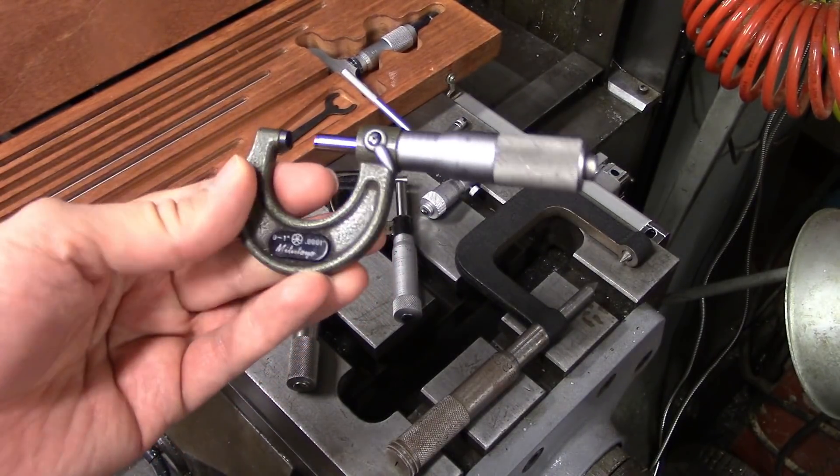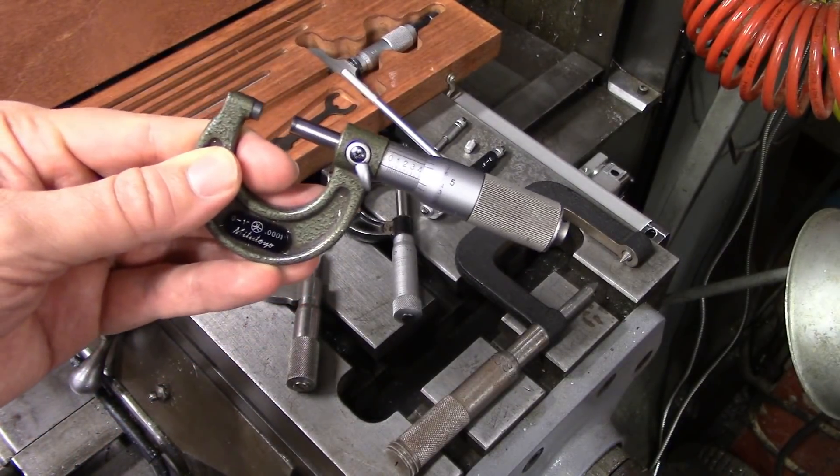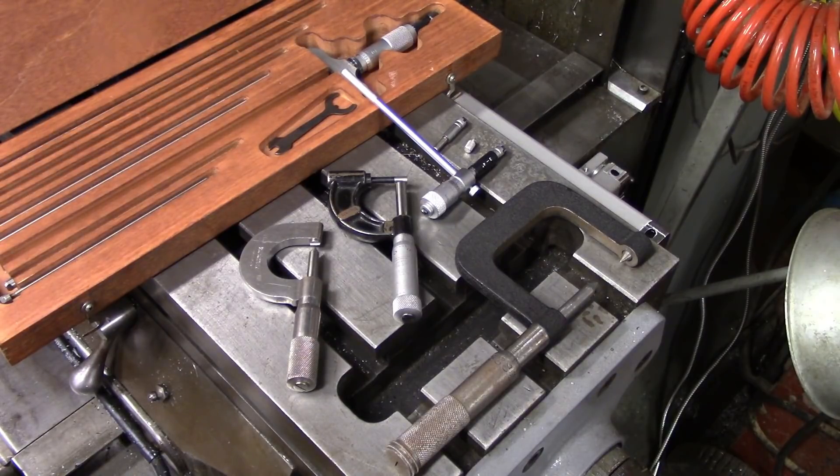You can actually see that even with outside micrometers — they make a lot more 0 to 1 inch and 0 to 25mm mics than they do the larger sizes. So while those specialty micrometers are very handy in the situations they're made for, if you do need one expect a little bit of sticker shock. If you really want to learn about micrometers, I suggest taking an industrial suppliers catalog and looking through the measuring tools section. You'll see a bunch of different micrometers that you may not have a use for right now, but it's good to know they exist in case you do in the future. That's actually a good tip for learning about all the tools of the trades, not just micrometers — looking through catalogs is a great way to see what tools are out there, and the more knowledge you have about available tools, the more likely you are to be able to solve any future problems. I hope this video helped — if it did, please consider hitting the like and subscribe button down below. And as always, thank you very much for watching.